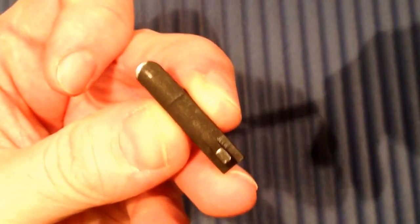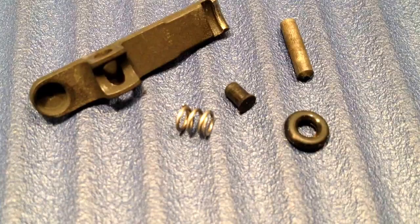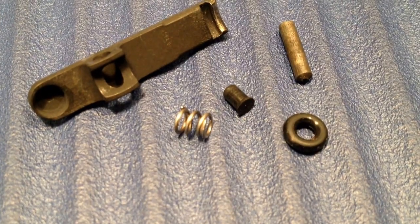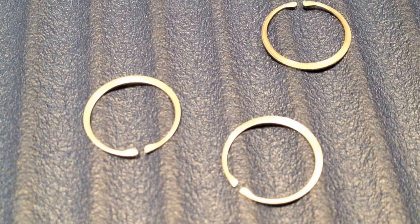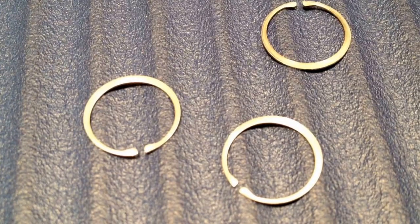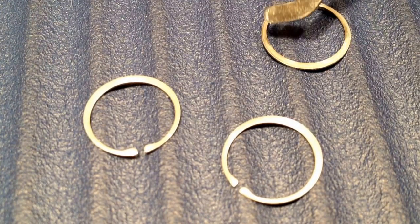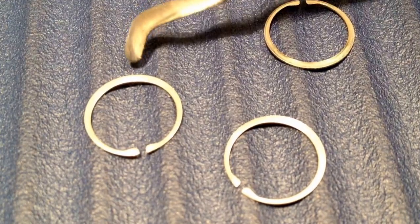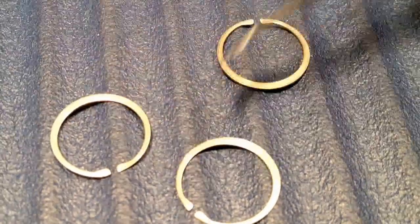The only slight wear mark is here at the end of it. The connector with all the parts will be changed for a new one. These are the gas rings — they still hold the bolt on a stand-up test fine but are a bit looser at the beginning, so they will go.